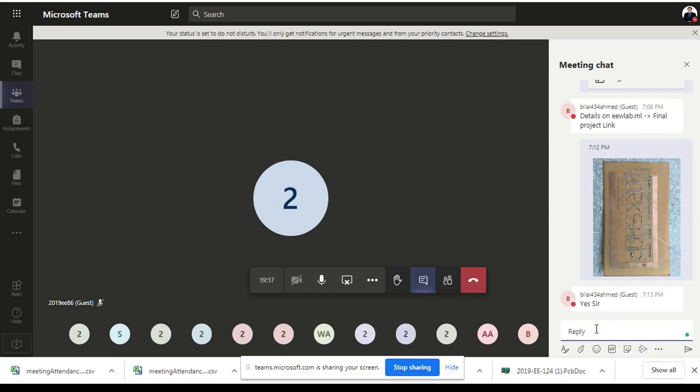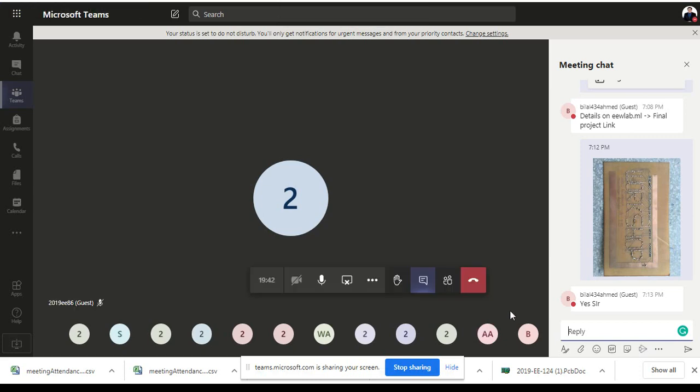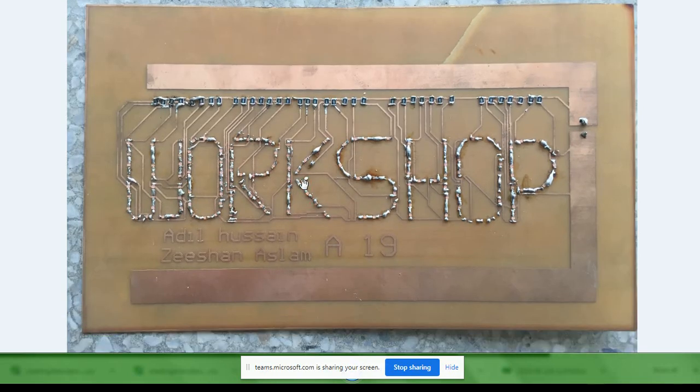First of all, find out where you are going to buy the red, green, blue, and white LEDs and determine their forward voltage drop — this is very important. The project involves some aesthetics: how you arrange those letters and how you solder them is very important. The overall appearance of this project is very important, so the whole PCB should look well-organized with LEDs properly arranged.